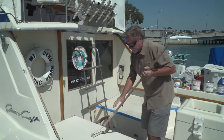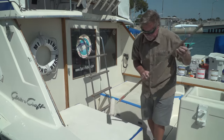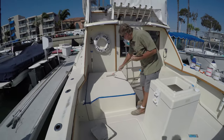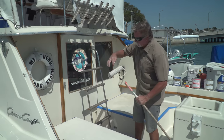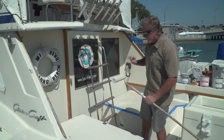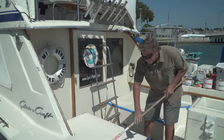You can see the rubber crumb stand up in here, so what you're trying to do is just get it as evenly as you possibly can. If you see any voids where there is no crumb at all, you can just go back and continue to work the material. If you try this with a regular roller it won't distribute the rubber crumb at all. This is what we call an open cell roller, and we have these at Tough Coat — they're very affordable and you need to use this if you're going to roll the job. This is a must.